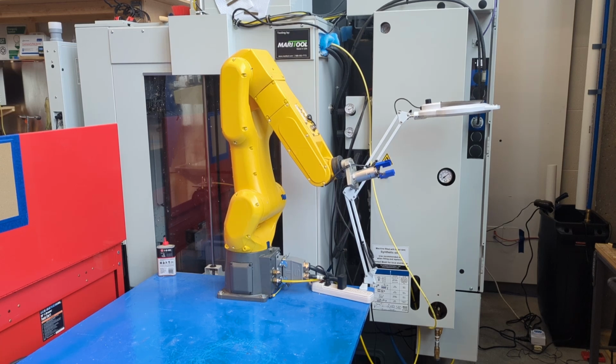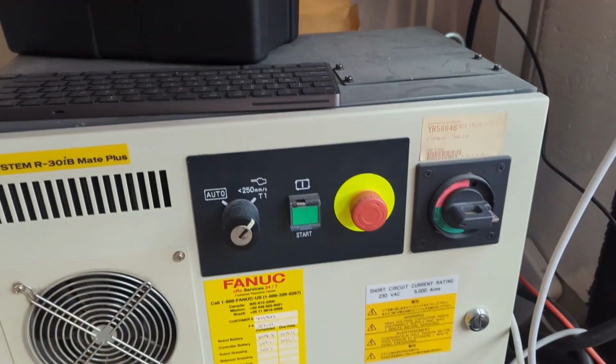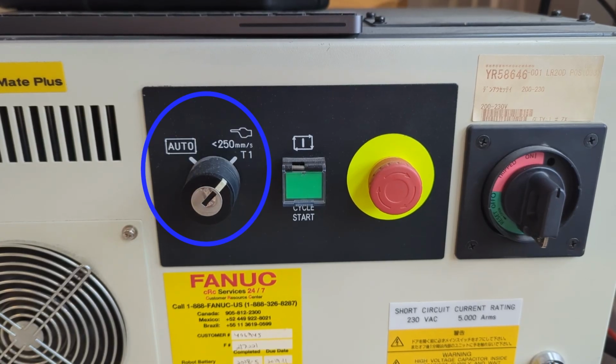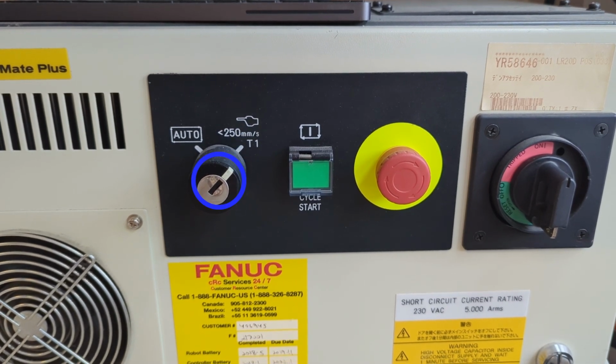Okay, learning to use a 6-axis robotic arm starts with finding the mechanical unit of the arm itself, and then finding the robot controller, the brain of the operation, and turning it on. Please look over here to notice that when you do, you're powering up in teach mode. And you know that you're in teach mode because this lock switch is pointing at it.